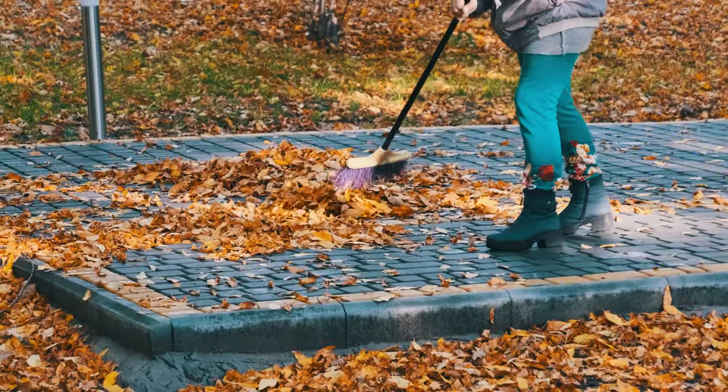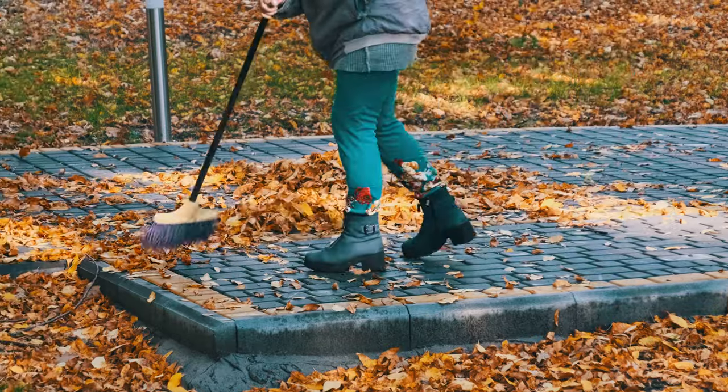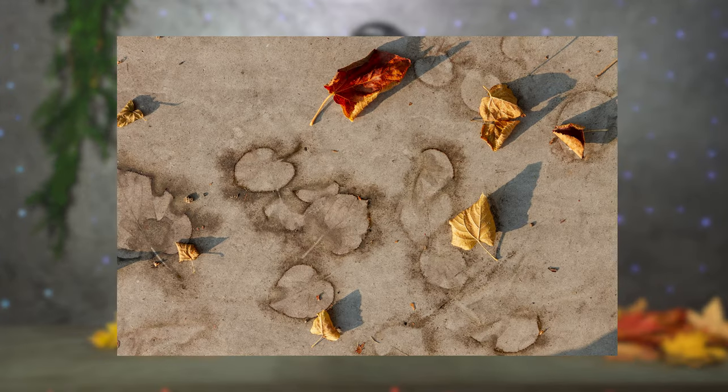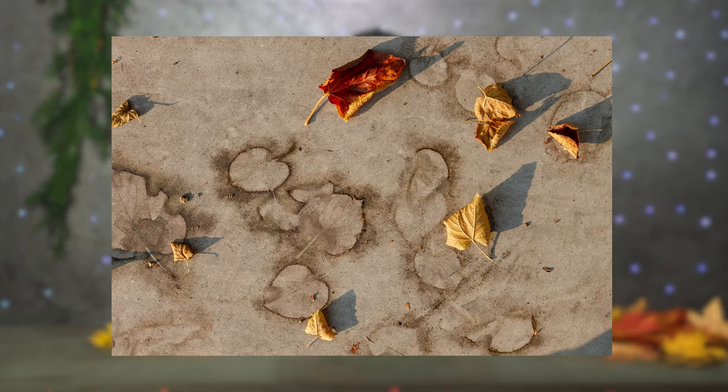That's not really what this video is about, but all I can say is just make sure that you always have a leaf blower on the job this time of year. Because leaf stains can definitely be hard to get off. We've done plenty of stamped concrete jobs that were poured in September, and by the time the concrete was cured out enough to seal, it already had a bunch of leaf stains all over it. I remember trying to scrub these off with a variety of different things and none of them really seemed to work very well.